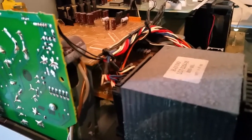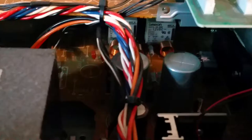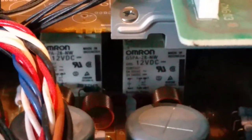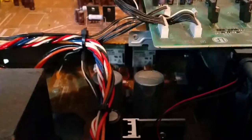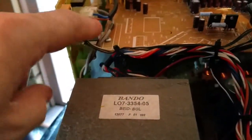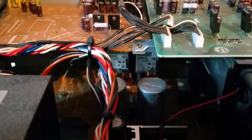I also can't see all the relays, but there are some more. You might just be able to see down in there — there's a couple of Omron relays in there. Caps aren't bulging, they're still all dead flat. There are your main filter caps, DC filter caps, and that's your AC filter cap there. How am I going to test those without actually destroying this thing? I don't think there is a way I can test them.